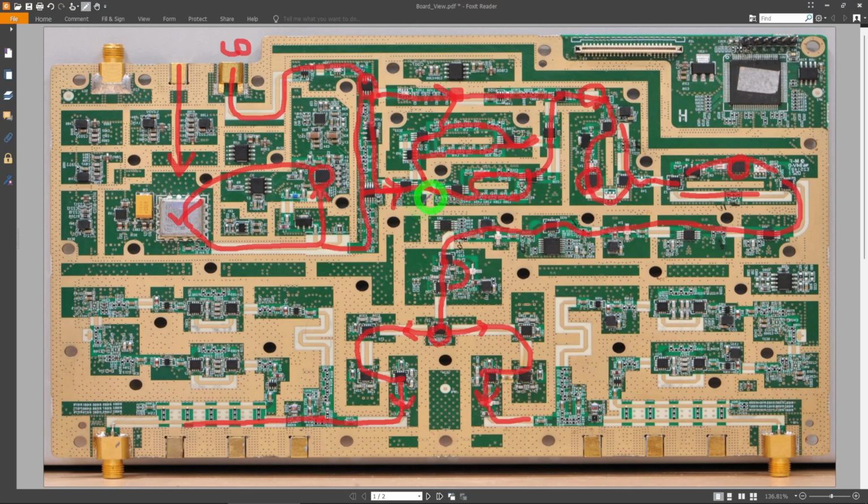So let's review that one more time, just in case it was confusing. We have a VCO from 2 to 4 gigahertz. I can use a multiplier to bring that all the way to 8 gigahertz. And I can use this mixer over here with an external LO coming in to cover frequencies below 2 gigahertz. So they don't have a divider, they have a mixer to cover that. So the synthesizer needs to generate this LO, and it needs to generate the reference signal in order to do all of the stimulus generation.